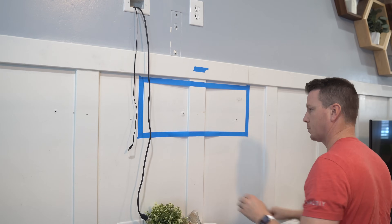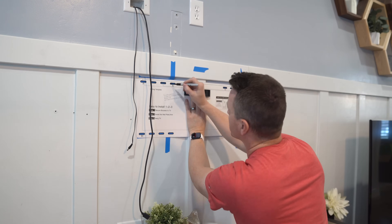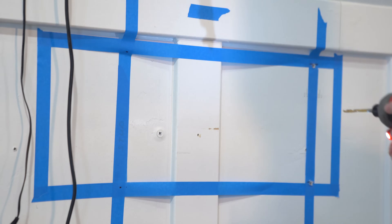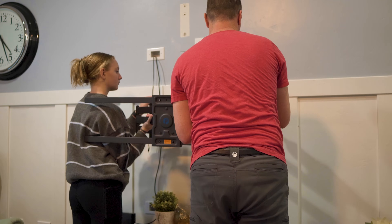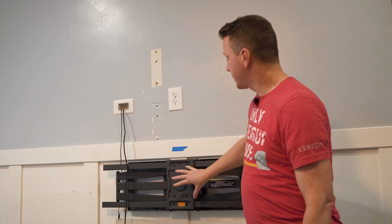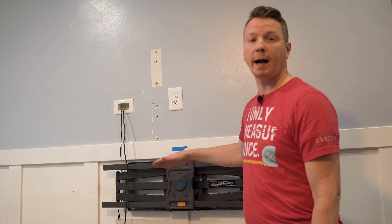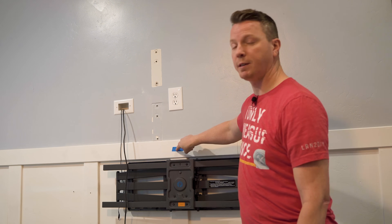It's helpful to use painter's tape to mark the location on the wall where your eyes naturally go. From there, use the mounting kit instructions to determine exactly where that mount needs to be in relation to those marks. As you can see here, I figured out exactly where my TV mount needs to go based on viewing angle positioning, marked it out with painter's tape, and I know exactly where everything needs to go. Note that the mount is lower than the center point of the TV, because the mounting brackets are on the lower half — this puts the center of the TV exactly where it needs to be.